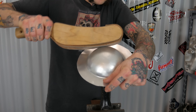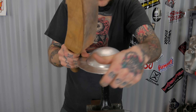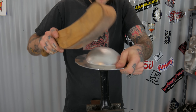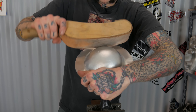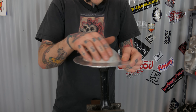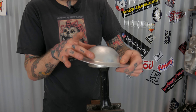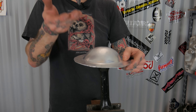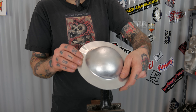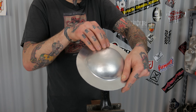And there's my little flying saucer. For my finished work I'm going to use this dolly here — a post dolly I picked up off eBay some years ago. It's meant for blacksmithing, but I had to sand it quite a bit to get the old casting marks out, and now it's ready to be used as an actual hammering dolly for finished work. With its dome shape it's really going to help me dolly this piece to back it up for smoothing out nicely. I'm going to start the finishing process with the leather face slapper so I'm not overworking the material to begin with.